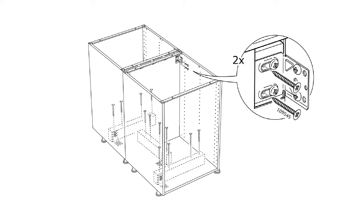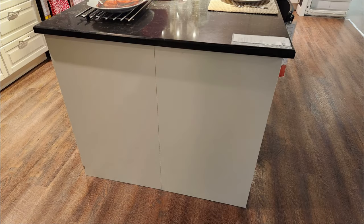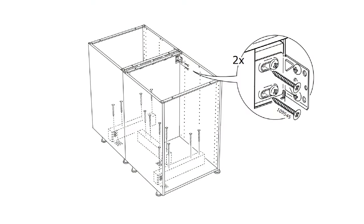Well, there are two problems with that. The first problem is that if you install these cabinets back-to-back we don't have any panels we can put on the side of those cabinets unless we cut the width of the cabinet. And if we do cut the width of the cabinet there's a big chance that where those two cuts meet it will look bad. So we want to have two cabinets sitting next to each other with no cut in between.